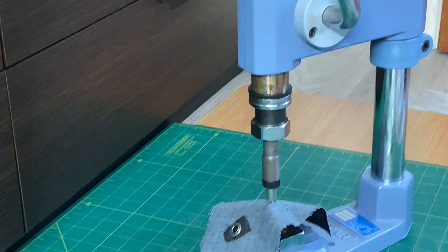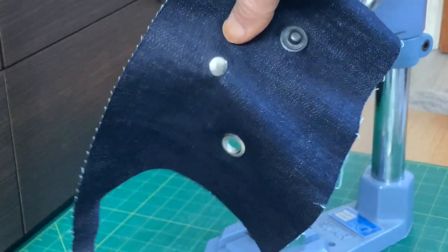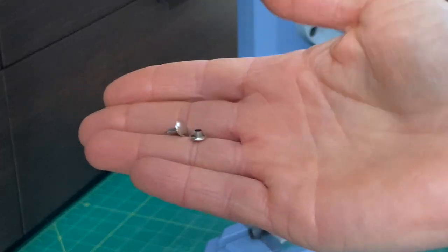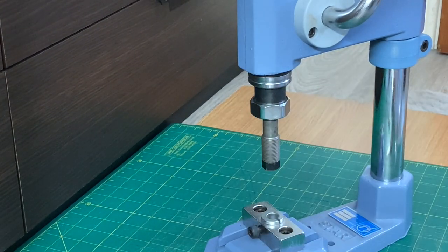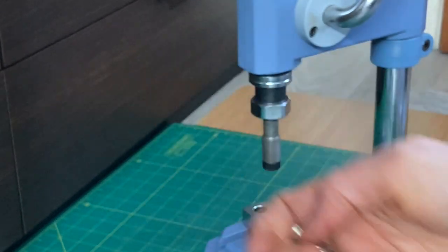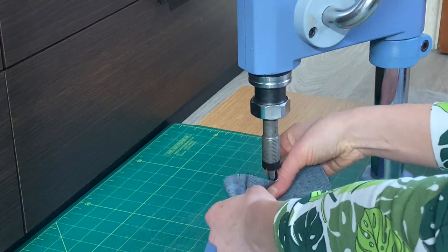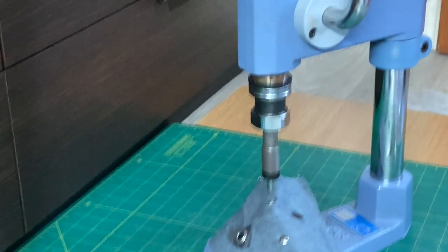You don't need a lot of force. I should probably adjust the force but I can't be bothered. It's not squashed — it looks right. It would be much better if the press was on a flat surface. I'm going to show you even smaller, three and a half millimeter rivets. I don't have small cutters so I'm using my awl. That force should be too much, but we'll see how it works — if it squashes my rivets. The threaded die on top, the drop-in on the bottom. The changeover is also extremely quick. I would recommend bolting the press to a stable surface because it works much better when nothing wobbles. The T-slots and alignment are very precise, so I wouldn't normally leave it misaligned.